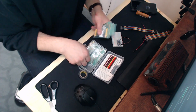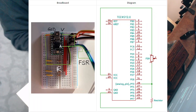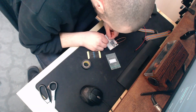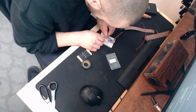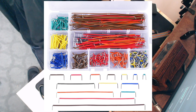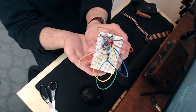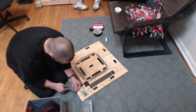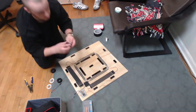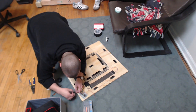Then I assembled my breadboard based on Serenny's guide. I'm not going to go into too much detail on this, but here's the diagram — just follow that. I used male to male DuPont wires to bridge all the connections, but if I was going to be using this pad long term I would probably either buy a nicer style of jumper cable or just make my own by stripping lengths of wire. Then I put the breadboard in the corner of the pad and plugged all the FSRs in. All the locations for where everything plugs into the breadboard are in Serenny's guide, and once that was all set up I was ready for the software.